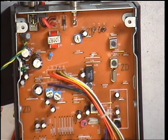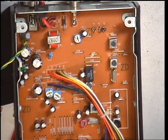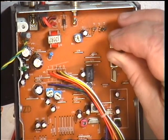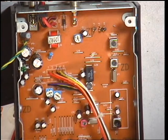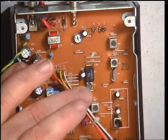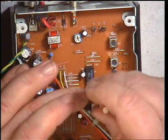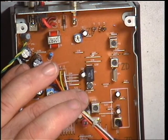Well, it's very good. I'm tempted not to touch the one which is sealed there - could well be the VCO. That's going to be the detector. So we'll just set that to S9, 100 microvolt signal, and adjust the oscilloscope for maximum output. I've just managed to get a little bit out of it there. We'll just see whether we can improve on this IF1.